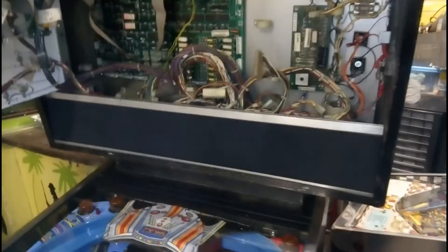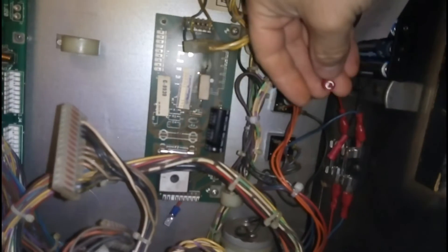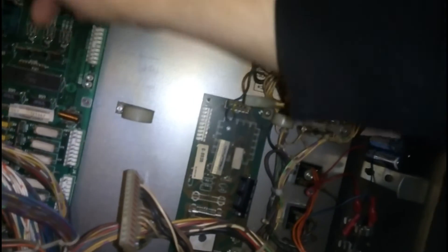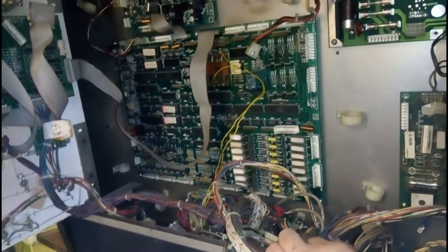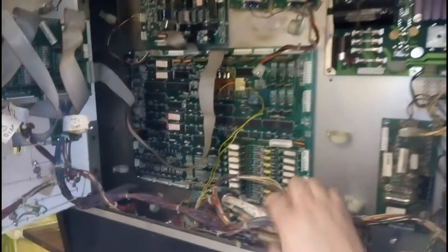I'll get this reassembled. The head is now attached and folded up. We've got this big pile of wiring to basically reroute and connect up. For some reason half these connectors have got bullet terminals on them rather than the original Molexes. It's got a homemade topper, a remote battery holder — they've even put a little note on to say when they've changed the battery, so that's nice. There's a scary amount of bullet connectors in here which are not labelled. I'll drag everything out and try to get it set up. I might need to trace the wiring out on a few things. I could do a change on that filter cap — it looks a bit old. I'll check for some burnt GI connectors as well while I'm in here.